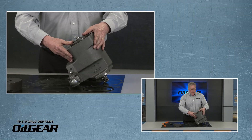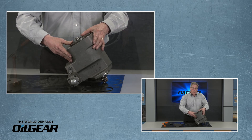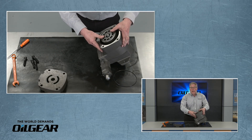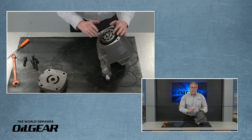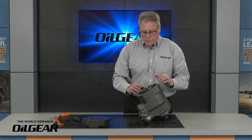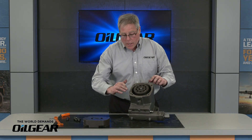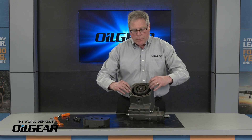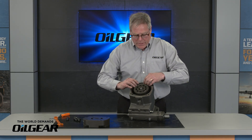At that point I can confirm that it's installed correctly by pressing on the cylinder barrel — I can feel the spring compress slightly. That tells me that the cylinder barrel is properly seated and the shoes are against the swash block. Double check our O-rings: the high pressure O-ring is in place, and we'll put the case O-ring into its chamfer.